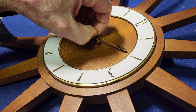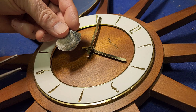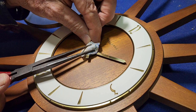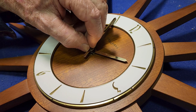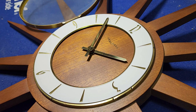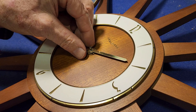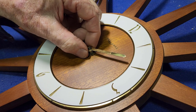There's a little knurled nut here that screws on to hold the hands. They're not normally too tight — if we hold the minute hand it should undo. No good with my fingers there, so we'll try with a little bit of fabric and some needle nose pliers so we can grip the nut and not scratch the hands. A little bit of care goes a long way — obviously the face of the clock is what everyone looks at and we want to leave it as pristine as possible. The minute hand goes on just with a couple of flat sides, and the hour hand normally just pushes on to a sleeve and pulls straight up with a bit of a wobble. I don't want to get a screwdriver under there and lever it up.